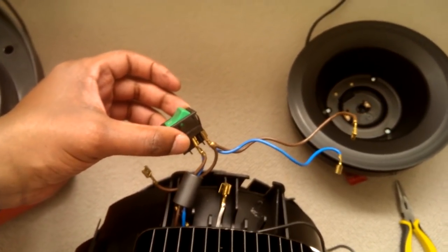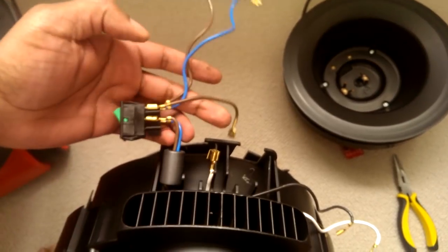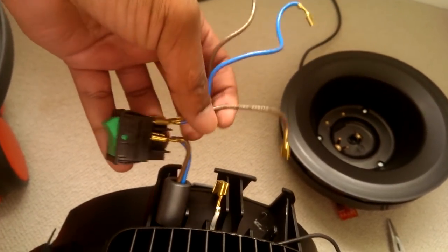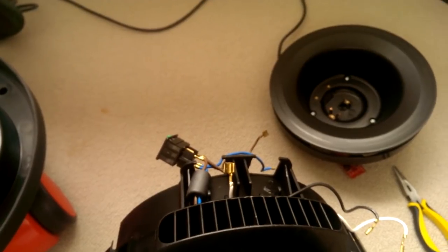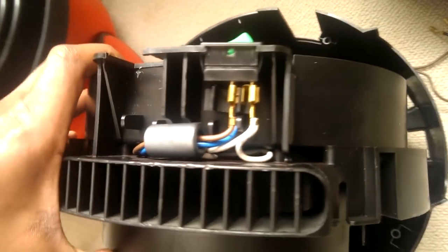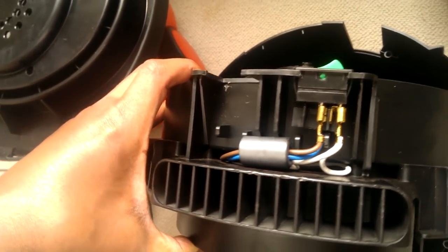With the PCB disconnected, you can see the useless wires coming off the on-off switch. This one used to go to the high-low switch, and these two used to go to the printed circuit board. I'm going to remove these two connections and connect in my white wires. There we have the two white wires now connected directly to the on-off switch.